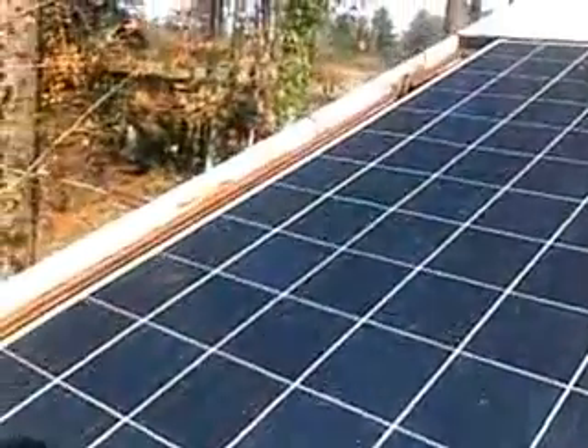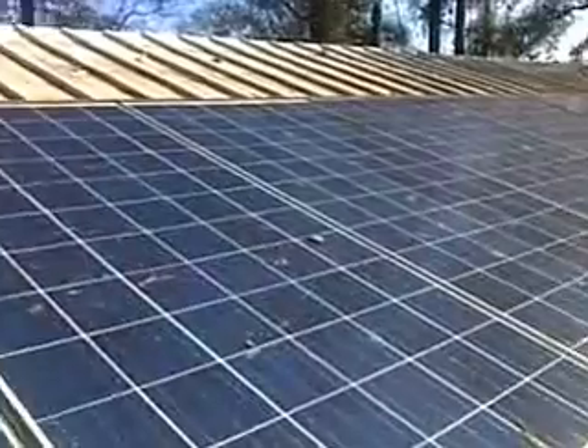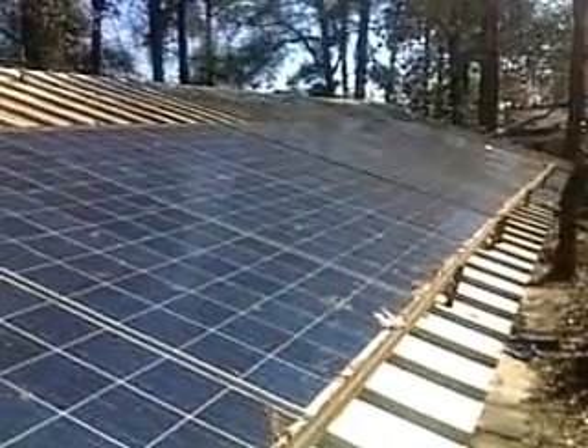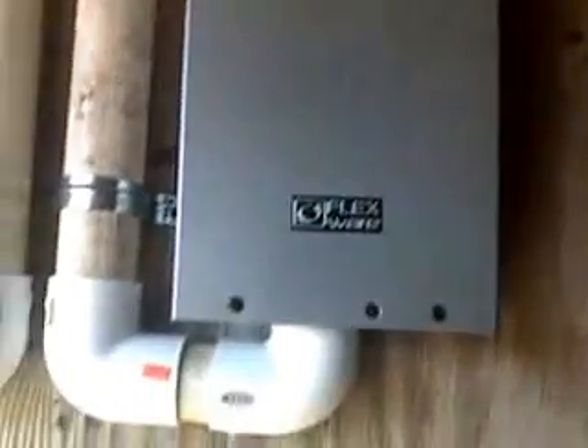Hello, my name is Gary Maul and this is a solar project I've done. It's twelve 300-watt, 8.5-amp panels. They come down from the roof into these combiner boxes — these are made by Outback. Everything goes under six breakers in each one.